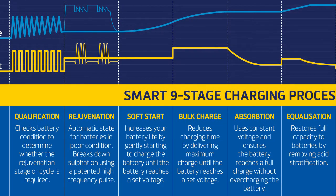Stage six: equalization charging. This is a well-proven process that carefully overcharges the battery to restore it to its full capacity. The equalization stage for sealed maintenance-free calcium batteries occurs automatically, and will only be enabled on AGM, flooded, and gel battery types if the initial start voltage was below 11 volts.